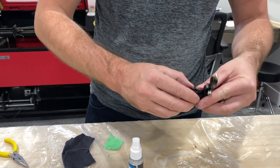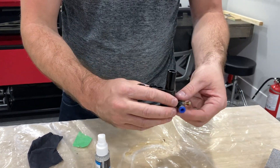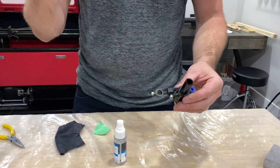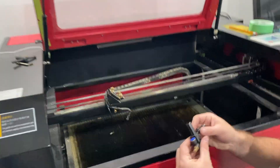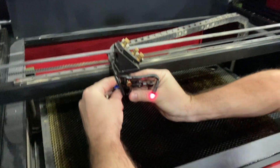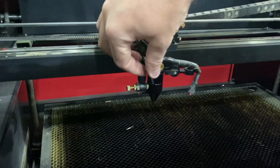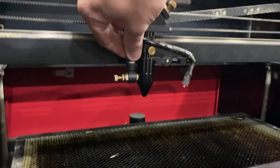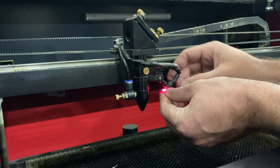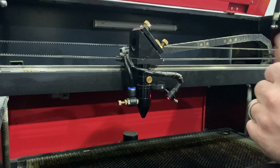I simply put this back in here. I know it should be just as tight so that these are on the opposite sides. Turn my air hose back up. Let's go back over to the laser and put this up here, right about up to the pencil mark that I made — which is again kind of hard to see on camera. I'm going to tighten this pretty snug so it never moves. This air hose goes right into this hole here. Of course, this is just the red laser that shows me where I'm going to be hitting. Let's tighten that, and when we're actually working we can move this into the appropriate place.